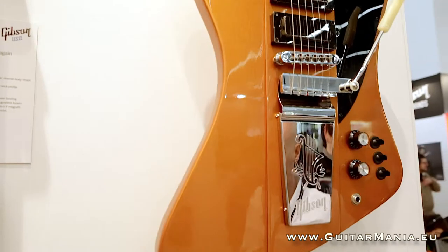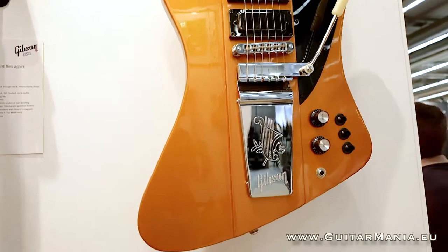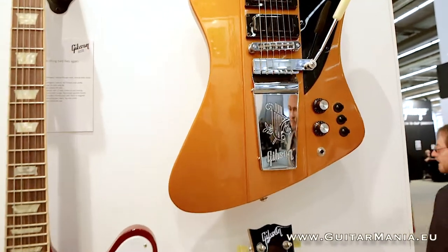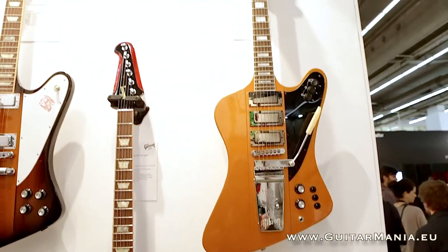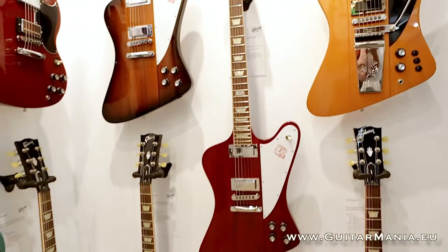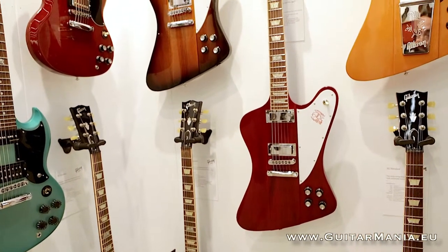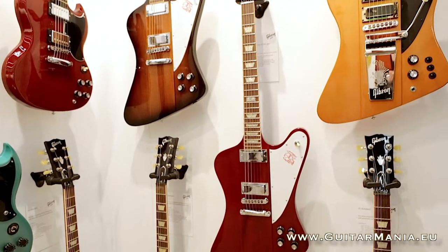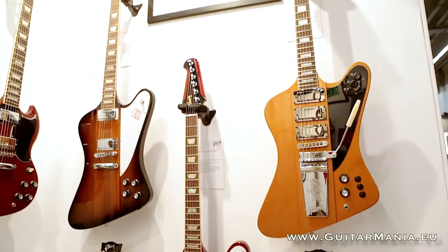As many of you know, Jeff has an extensive recording history and plenty of session work — Steely Dan, Doobie Brothers — so he wanted a really versatile instrument and still classic at the same time. The mini humbuckers have been redesigned so they're a higher output, not a distortion class, but a higher output mini humbucker, about the same output level as a PAF class humbucker, and then when their coils are split they have a classic chimey mini humbucking tone.